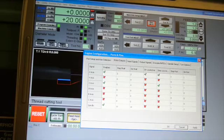And the spindle is on step pin 16, direction pin 14, and enabled — obviously on number 1 port for both.